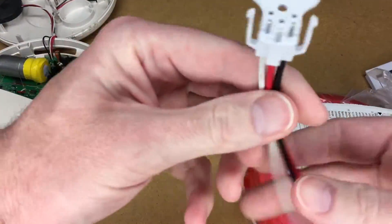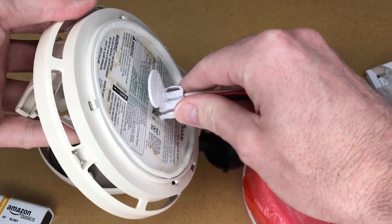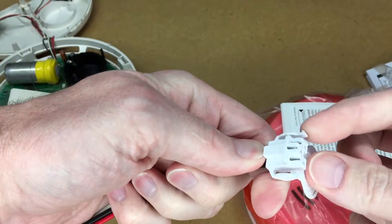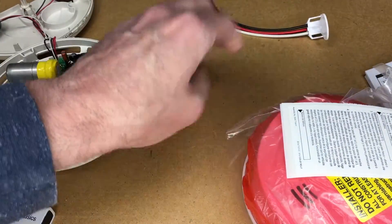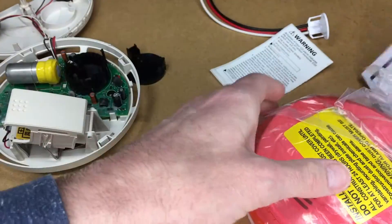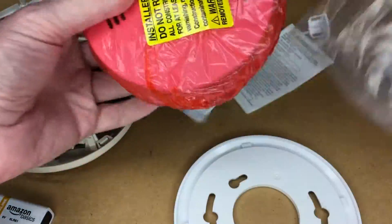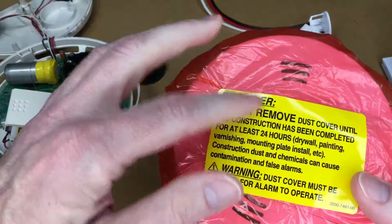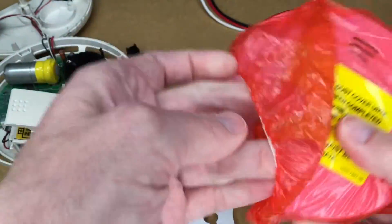Here's the new one. Here's the pigtail — I already have one on the house so that'll connect right onto the old bracket; they're the same. I won't have to rewire it. I'll keep the new pigtail in my parts bin since those little ears can break off. It also comes with a little sticker, instructions, and a protective cover — like a little shower cap. If you're doing drywalling or painting you can leave that cover on it to keep it clean, then take it off when you're completely done.